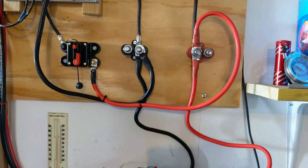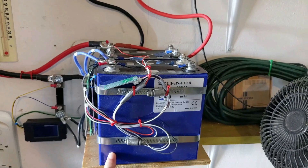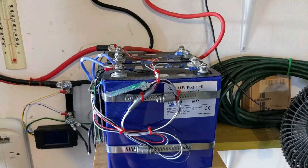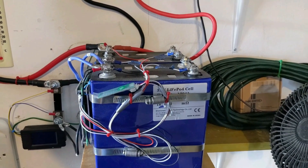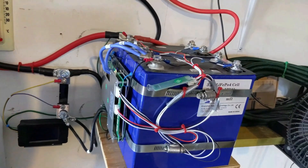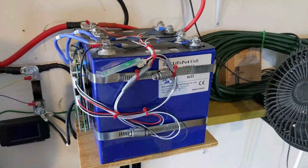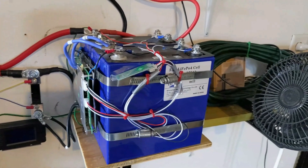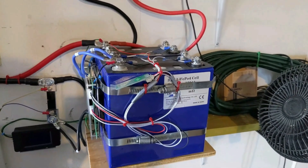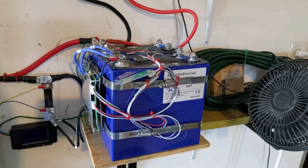The second leads come down and charge my battery — a 120-amp hour, 12-volt battery that I built myself. You don't have to build it yourself; there are retail options on the market and I'll put links below if you're not comfortable building it. The capacity is 120 amp hours at 12 volts, offering 1,440 watt hours to run my appliances. The BMS controls the battery, making sure it does not overcharge, over-discharge, or exceed a safe temperature range — it's basically the brains of the battery. Retail options with similar capacity and functions are linked below as well.